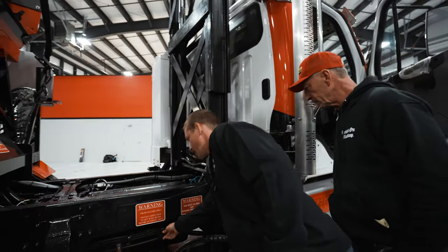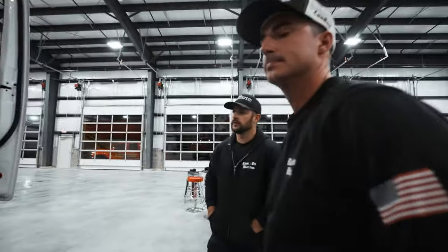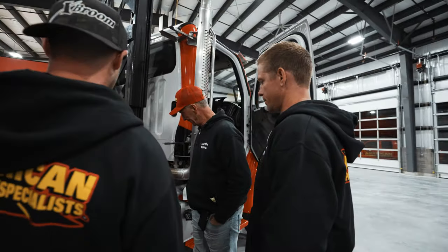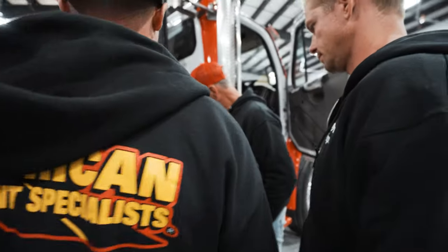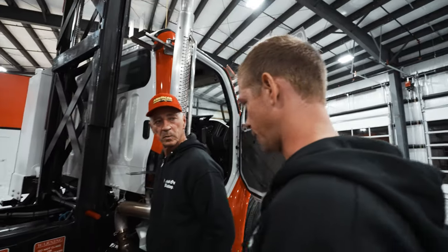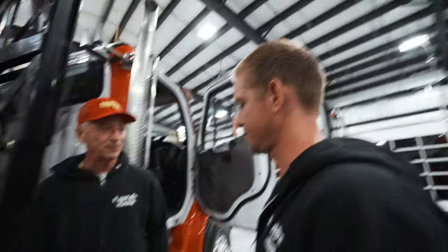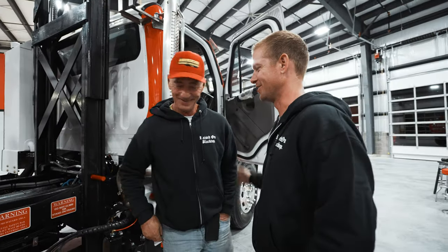Oh, yeah, but you can kind of see here too. So hydraulic hoses, how we mount them, P clamps, hydraulic hose clamps, on chain, so it won't move around. Stuff that's going to last forever. And that center divider, you go over a structure, yeah, the rubber just folds out of the way. It's just single ply. So, yep, simple stuff. Beautiful work, man. Thanks. Appreciate it.